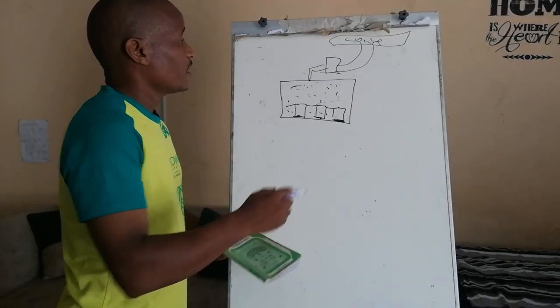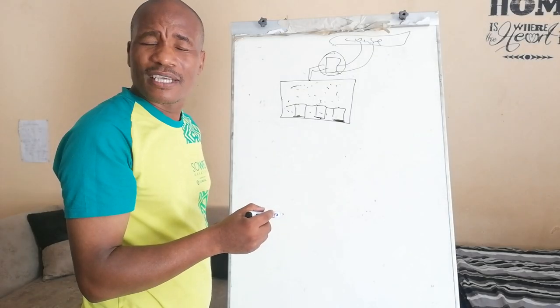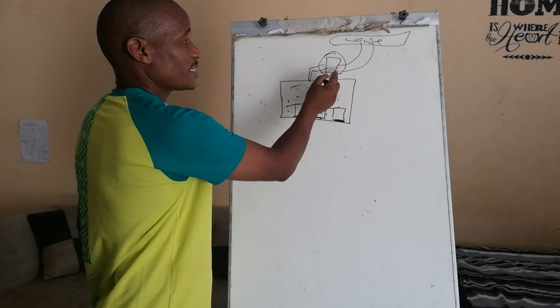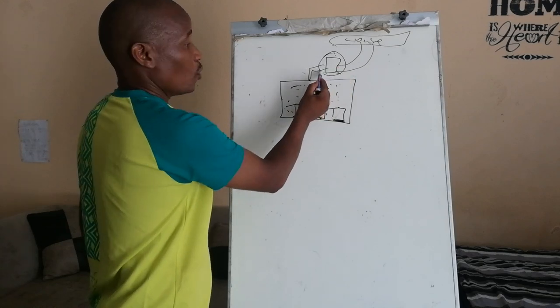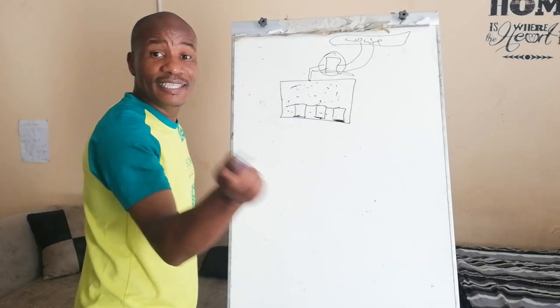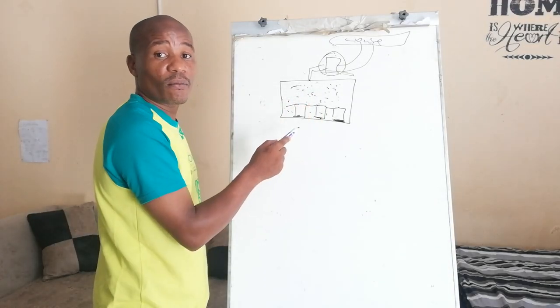And then here, this thing is a gas actuated switch, and we call that a Buchholz relay. Initially, we explained that it has two main mercury switches, the upper one and the lower one. The lower one is responsible for switching off the transformer in the event of faults inside the transformer.